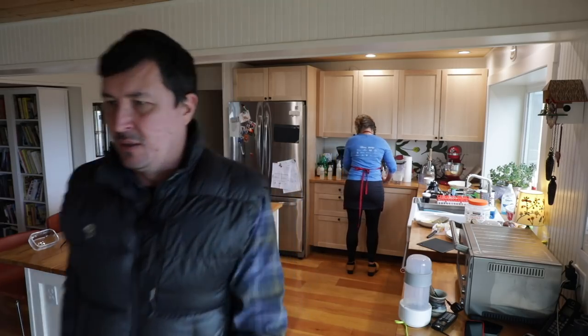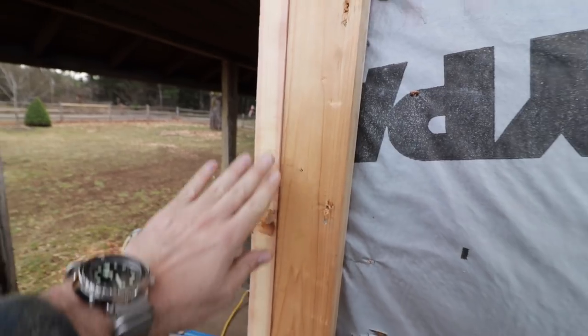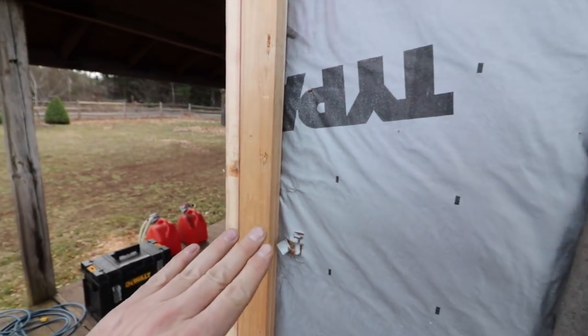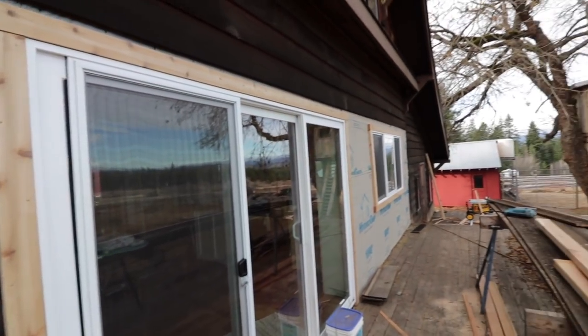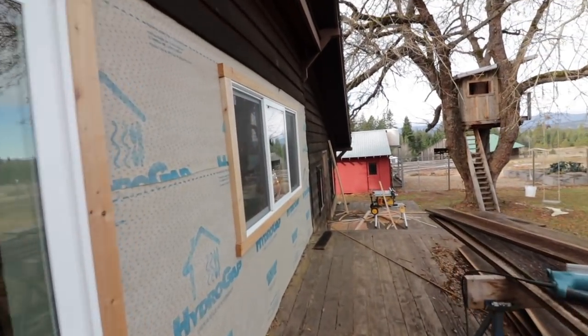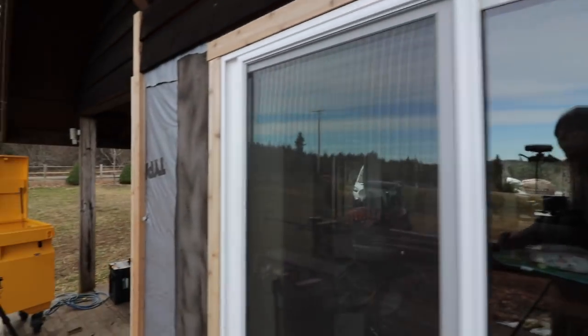Going back to the siding — here's the finished corner, nailed into the framing. That looks a lot better. See how the siding runs into the corner board, versus what we had before, sitting on top of it. Not so nice. Around here, same thing. A little bit proud right there on the edges — I'll take the belt sander and sand that down, caulk that joint in, and now we can run the lap siding in. I finished trimming all the other windows, so we've got this all done and we're ready to start putting the lap on.